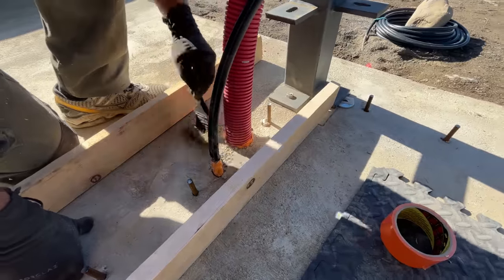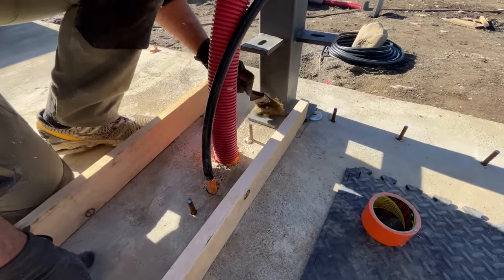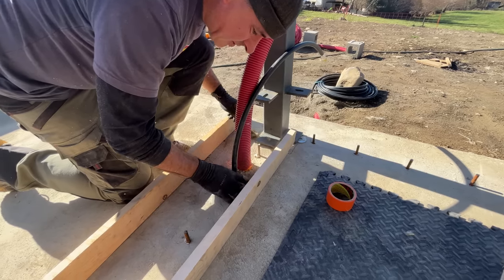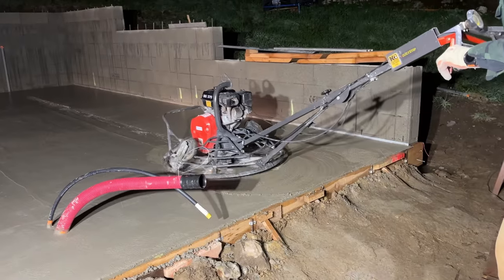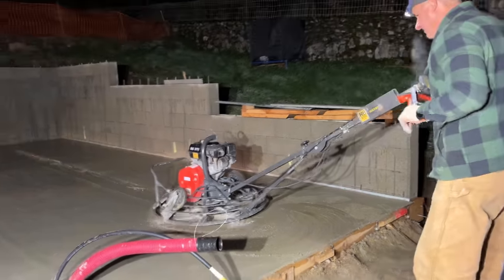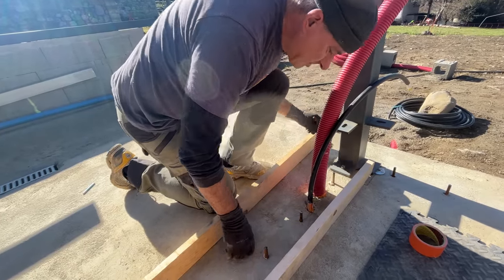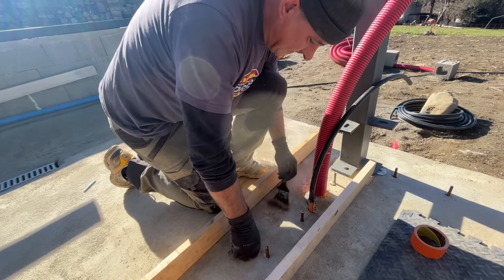So these are my two service pipes, water and electricity. So these are going to be formed within this concrete upstand, which will tidy it up a bit. So I put this tape on just to protect it when I poured the slab. If you remember back, I cut through this conduit with the helicopter, the power trowel, and that's when I stopped using it. So it gave me the opportunity to wrap some tape around and actually seal that in concrete again.